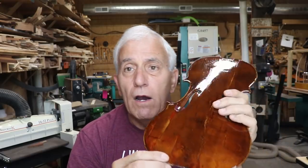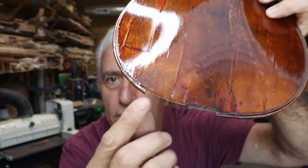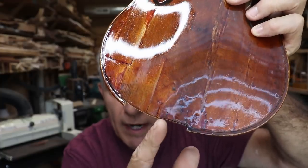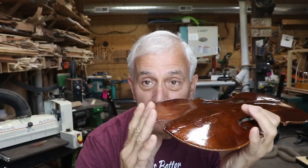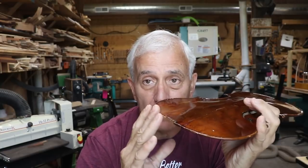Now for the epiphany. This part of the wood is missing here — it needs to come over to the square point. It's missing a kind of round-over, and it's end grain. Gluing end grain to end grain never works, even when you have a large surface area. I don't care what kind of glue you use. The only glue you might get success with is CA glue, and that's only because it sticks to itself — you fill the end grain with CA glue and then glue the two end grains together.